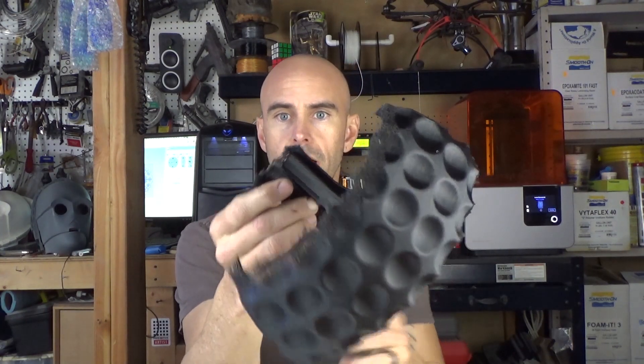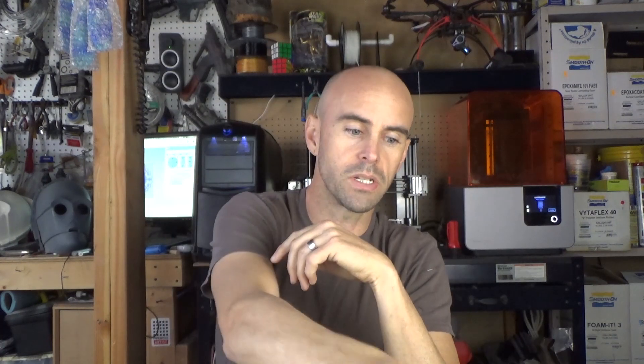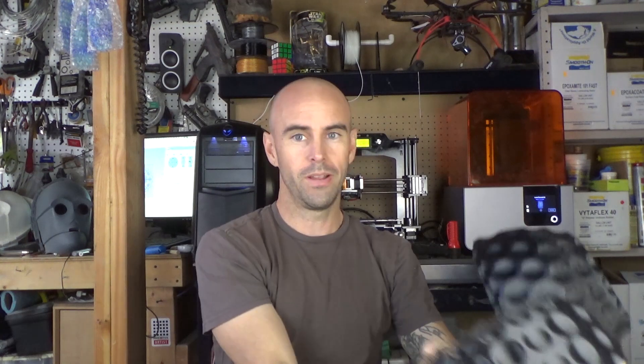It's got filament detection — so if the filament runs out, the print will stop. And it also detects whether the filament is moving, so even if there's filament in the feeder, if it stops moving for some reason like a clog, it will stop the print and give you a chance to change the filament so your print doesn't get ruined. That's huge, because I've had situations where I'm printing a big part, it gets a clog five hours in and now I have to start it over. Look — here are three prints all jacked up because of clogs. With the other printer, it would stop and I wouldn't ruin the print.